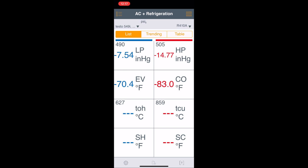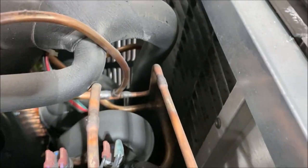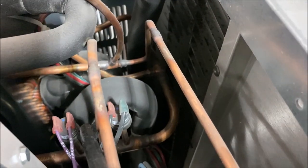As you can see we have little to no refrigerant here. Let me turn off the system and see how much refrigerant is actually in here. We're in a vacuum, and we're at 1.4 — we don't have much refrigerant. So let's put in a trace amount of gas and pump it up with some nitrogen. I'm working up on the ladder here — it's going to be a little tricky to film, but I'll do my best. We're on top of one of these ice machines, so let's go ahead and do a leak test.